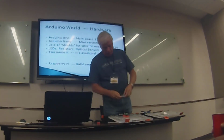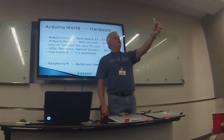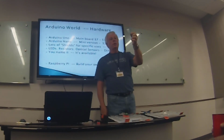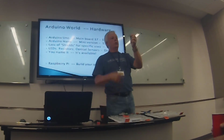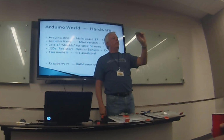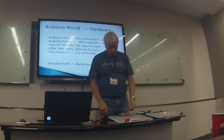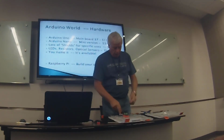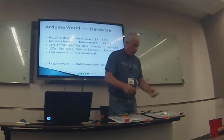After you get it all prototyped and you're ready to install on your layout, you take one of these things and then you solder the stuff together, okay? So it looks neater, takes less space, not going to fall apart later, wiggle out on you, that kind of thing. So you just got all these holes and they're all lined with the metal. So you put the pins in there and then solder it on the back. I got a whole bag of these for a couple bucks. Called a prototype board. But this is a breadboard. This is what you play around with.